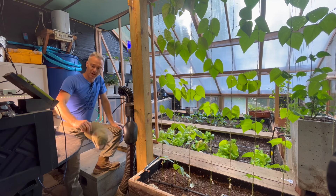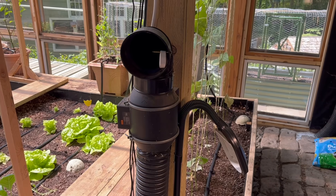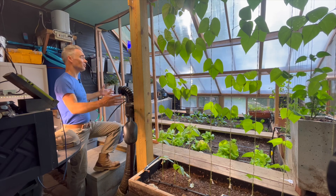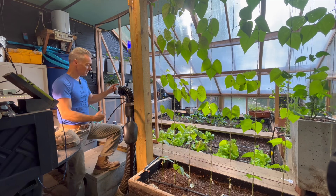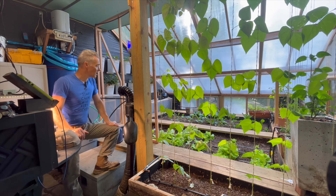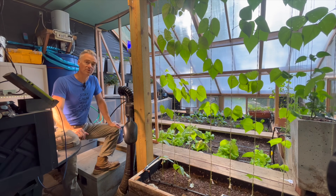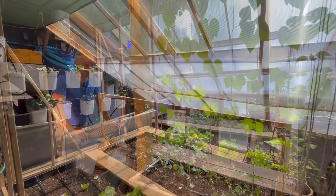If you haven't seen my other videos about what a geothermal greenhouse is, here's the basic idea. You see this tube coming up out of the ground? There are hundreds of feet of it below ground underneath the raised bed. There's as much air volume in that tube as there is above ground inside the greenhouse. I pull that air out with an inline fan. Below the surface the ground stays about 50 degrees, so in summer that 50-degree air blowing in is almost like air conditioning, and in a cold New England winter, 50 degrees is actually pretty warm. So it cools in the summer and heats in the winter.